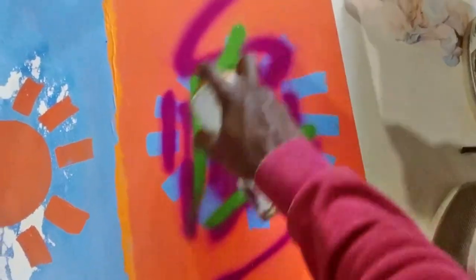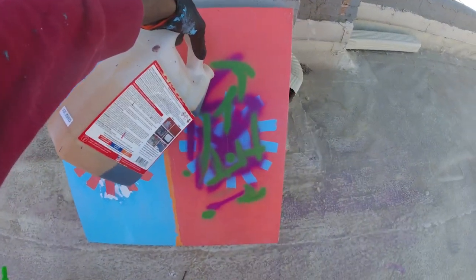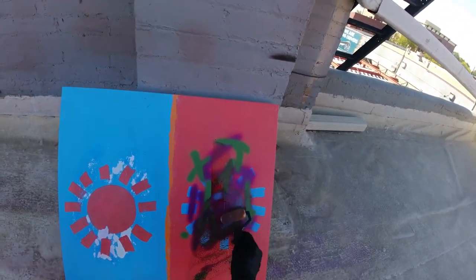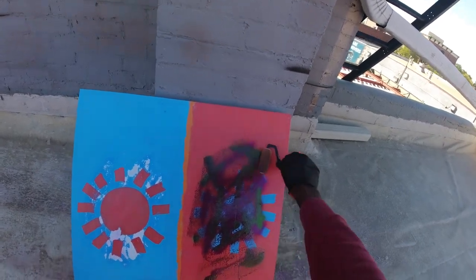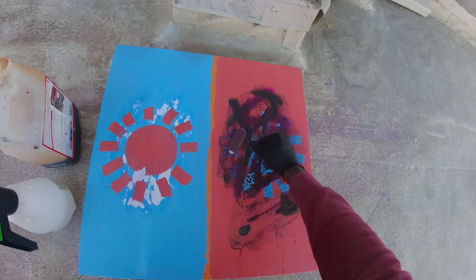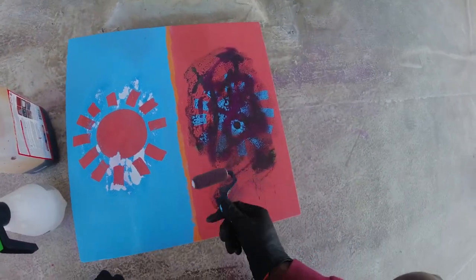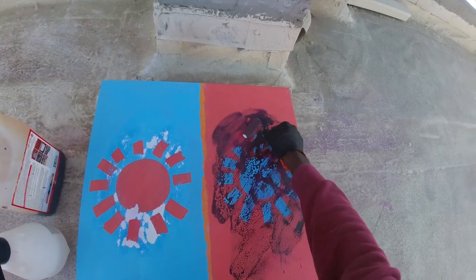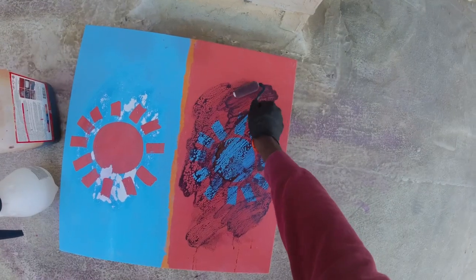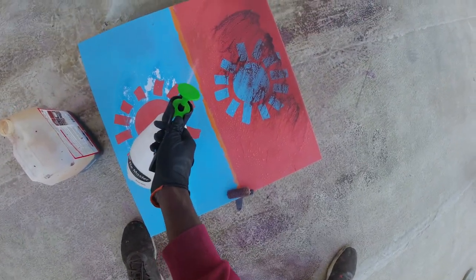I even went back and did another round, throwing spray paint on top of the non-sacrificial Sherwin-Williams coating just to see if it would hold up to another round of cleaning. All I did was pour on the graffiti remover solvent again and agitate the spray paint even more. The more you rub, the more you can see how it really just breaks down any type of paint. Note: this is really toxic material, so make sure you wear gloves and eye protection at all times — you don't want it splashing in your eye. I'll have this product linked in the description. It's made by Mural Shield — muralshield.com — based in LA, and they make a ton of products to help preserve your murals.